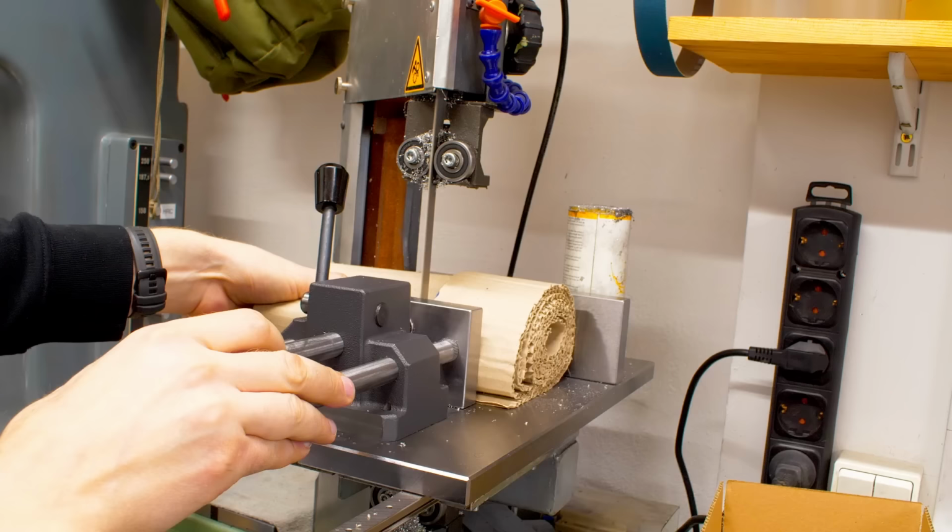I cut 5 pieces, 40mm long each. I need 2 with a 2.1mm hole on the ID and 2 with a 4.1mm hole on the ID. Tolerances are loose-ish. There is nothing super critical. They just need to be nice. I cut 1 spare in case something with the wire cutting goes wrong. Also, these are long enough so I can get 3 bushings out of them and still have some stock to hold on to for using the cutoff wheel.